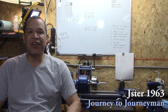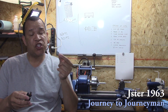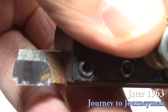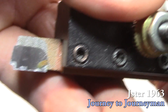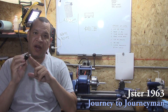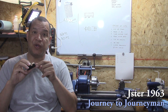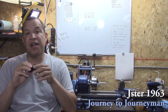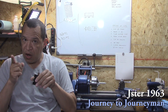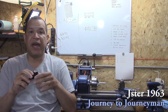A couple of lessons learned on this: number one, aluminum is softer than carbide, however if you're doing an interrupted cut and you work it too hard, you can break off carbide with pop can aluminum — so be careful on interrupted cuts because it can break your tooling. The other thing is, once you get a hole started and you re-tighten the jaws, it will move the hole off center and you're going to have a hard time getting it back.